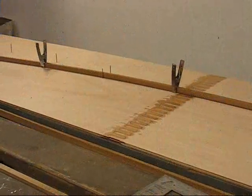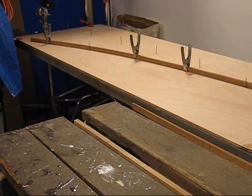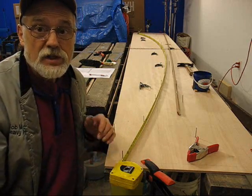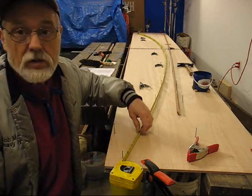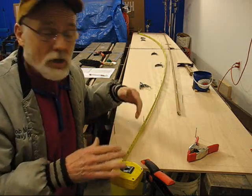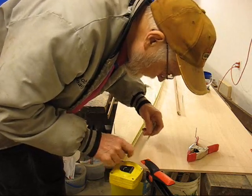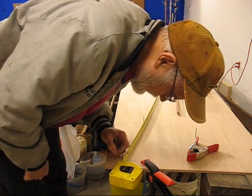I'm happy with the line going down on that arc there to where it comes in to the stern, so I'm going to go ahead and mark that one up with a pencil. We'll switch over to the top now. The other thing you want to do before you pull up the nails — especially on a prototype — is lay your tape out. Put a clamp on the other end but put the numbers above so the arc of the tape follows the line along. Then mark down to where it comes out at the end. Looks like 157 some inches will be my arc length.